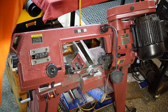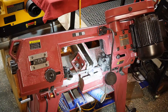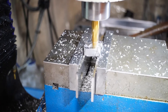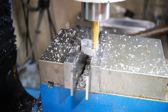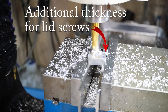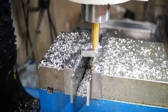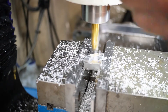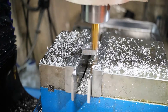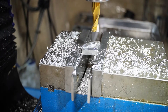Finally we're ready to cut the part in half to make the two individual identical hinges. The bandsaw makes quick work of that. Now each half is face milled in turn to get them cleaned up to proper thickness. I decided to leave a little additional thickness where it'll mate to the lid, so there's extra room for the mounting screws. The same face milling operation is done on the second hinge piece, but this is where the hinges diverge for the first time — the additional thickness needs to be on the inside face of each hinge, so now they're mirror images of each other, giving me unique left and right hinge pieces to keep track of.